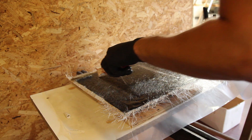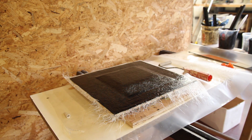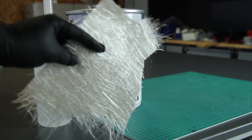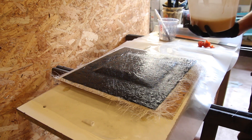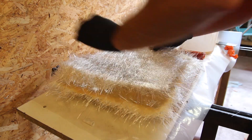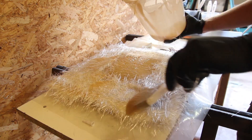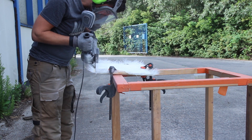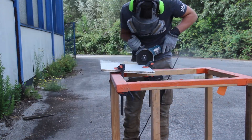We use the coupling coat to make a good bond between the gelcoat and the tooling resin on top. I use a roller to remove all air bubbles and evenly distribute the coupling coat over the part. For the first layer we use 100 grams per square meter. For the finishing coat — the UniMold tooling resin — we use 400 grams in chop strands in four layers. I apply a layer of resin on top of the coupling coat, add the fiberglass, and roll everything evenly. After a post cure in the oven you're able to trim the edges.